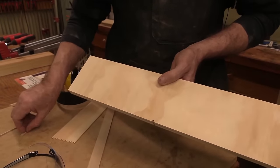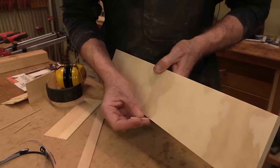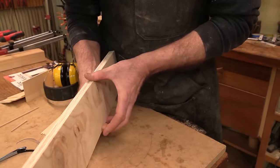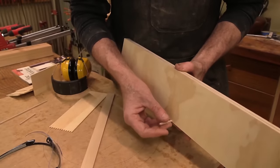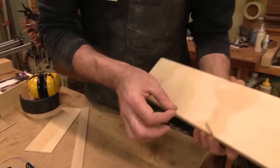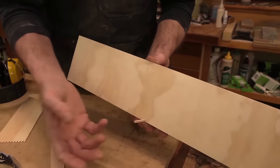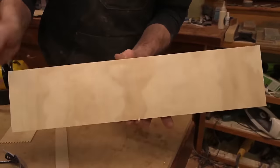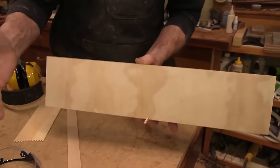And then I cut on the bandsaw a shorter version. All you need is a piece that sits in there and is about flush with the back and just sticks out about an inch and a half or so. So I just get some glue on there, and then glue it in and let it set up, and then you'll have a nice square indexing pin. That's all you need to start with.